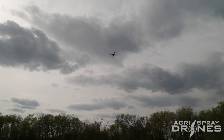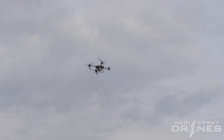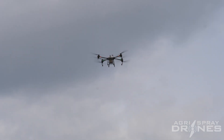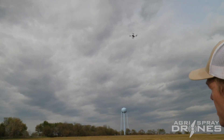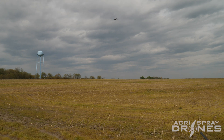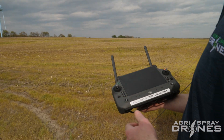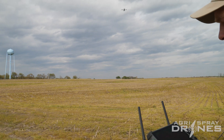For area mapping like this with the T40, it's only allowing you to do 33 acres at a time. That's essentially because of how much processing power the remote has and how much flight time the T40 has to take those pictures. This takes a lot of processing power to stitch high-resolution imagery, so the remote can only do so much with a limited processor. The drone just took one row of pictures, it's turning around, and it's going to keep taking pictures as it flies the next line.